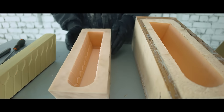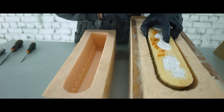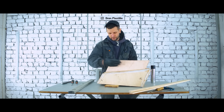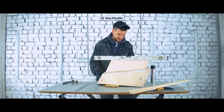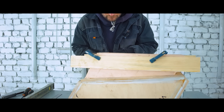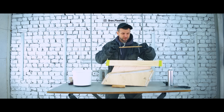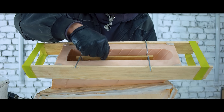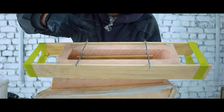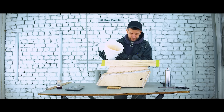We're gonna cast this silicone piece into this mold. We're gonna hang it over here, and there's space between them — we're gonna pour colored epoxy resin there to finally create the light. Some preparation before pouring: I made this mold using the simple method with single-use foam. We can save a lot of time and effort this way. Let's even it out. To stop it from bloating while pouring, we're gonna hold it with slats and clamps. The clamps are refusing to work properly, but duct tape did a great job. I came up with a structure to suspend the matrix inside the matrix, using thermo glue to stop it from floating since the base is made of wood — silicone will try to push it to the surface. Pour it in a thin stream aiming at one spot.